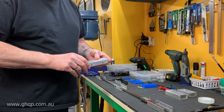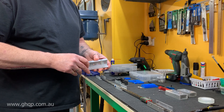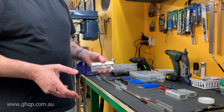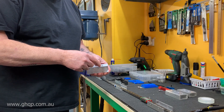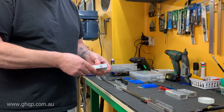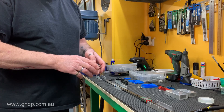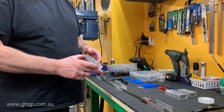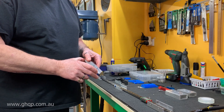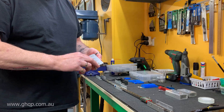I'm fortunate to have a CNC router to do it this particular way. If you don't have that, it's not a big problem. There is a diagram attached to this file that can be downloaded with all the dimensions. You could just put round holes in the sides — I'd suggest around 3.5mm — and you could drill and tap the aluminium M3 straight down the centre with the correct spacing. You could make these using standard machine tools, even just a hand drill and an M3 tap, but you'll just have to be a lot more accurate with your measurements and drilling.